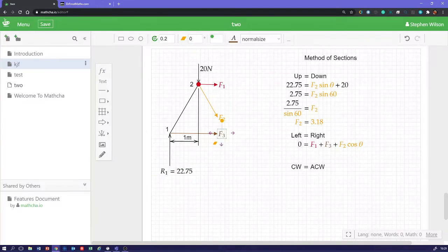So remember, that's a force times by a perpendicular distance. So if we're looking at the perpendicular distance, well, the perpendicular for F3 is going to be the height, isn't it? Now, just a bit of calculation here. So that's 1 metre to the halfway point. So our equilateral triangles are 2 metres each side.